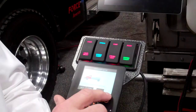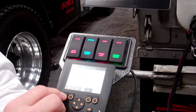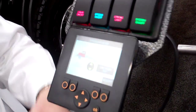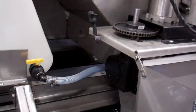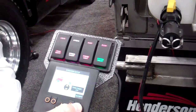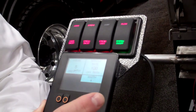We'll choose full ground speed mode. When you go into that, you choose the types of materials so that it spreads the right amount — whether it be salt, sand, or a sand-salt mix. We'll choose salt. You then set your gate height. This is the gate on the conveyor system and it's pre-graduated on the lever, so we'll say this one is at three inches, and I'll accept that. And we're set up, so I will accept that.